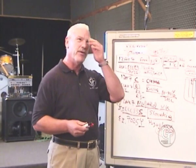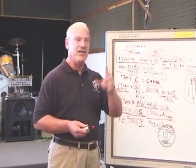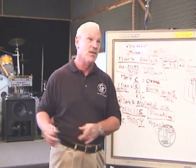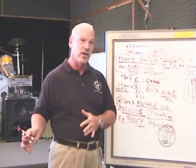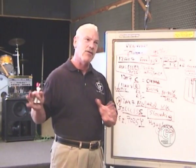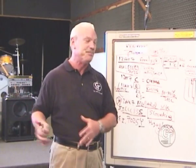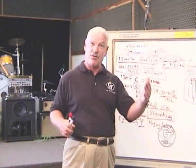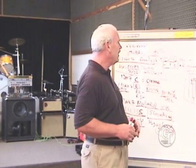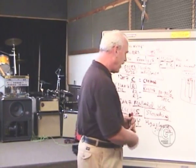So when you're changing a preamp tube, you're really changing the tonality of the amplifier, not so much the feel and the response characteristic. That comes from the power stage. You want an earlier distorting or later distorting power, softer, tighter, cleaner, softer, mushier. That would be a power tube decision. So we'd go with a lower or higher number rating, or we'd go with a different kind of tube, less or more power. Preamp tubes, each of them have a function in the amplifier,